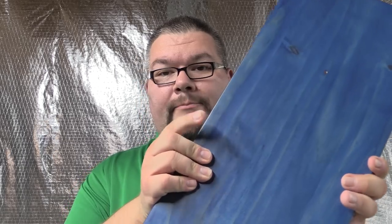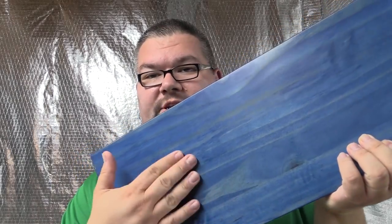I hope we both learned quite a bit — I know I have. This video was not meant to be the end-all be-all of instruction videos; I'm just a guy working in his basement trying to learn this stuff as I go. I need to go back and clean up these edges — I'll probably hit that with some sandpaper by hand and apply another coat or two of urethane. I'm also not really happy with some areas where I didn't get the stain moved around fast enough and we've got some splotchiness. That would have been preventable if I'd worked a little faster and put the stain on a little thicker — but again, that's a lesson learned.